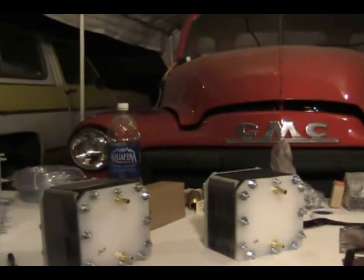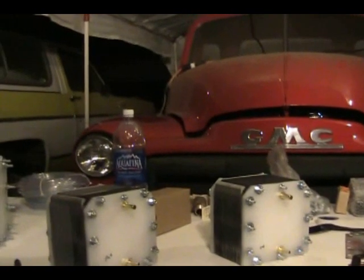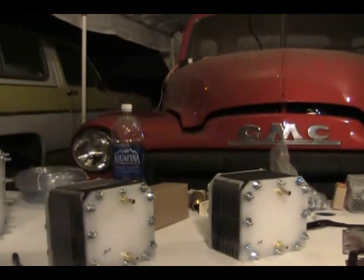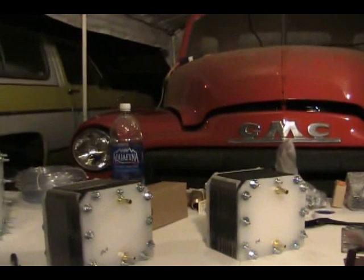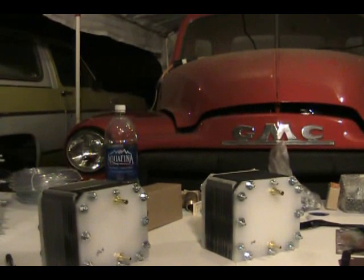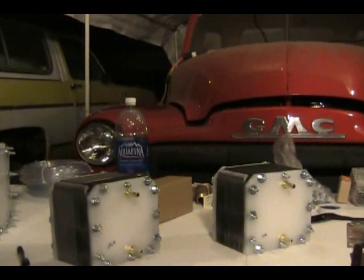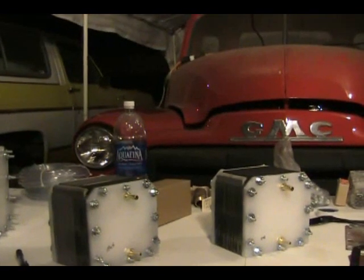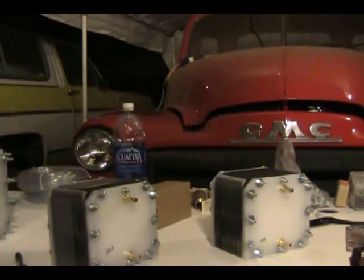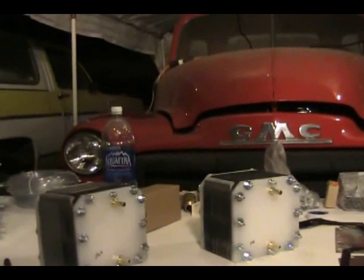Having electrical connections inside the cell is dangerous. If you've watched my video of what can happen, you've seen what happened to 10 of my wet cells simultaneously detonating because of a poor electrical connection. I used stainless steel hardware inside the cell — but stainless steel is a very poor conductor. To pass high amperage through stainless steel as a connection — like what a lot of parallel cell designs do — it gets hot. You might as well put a heater element inside a hydrogen-oxygen environment and turn it on. Plus, it makes reconfiguration difficult.